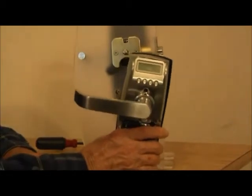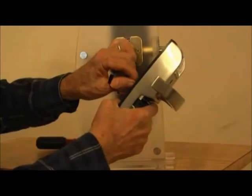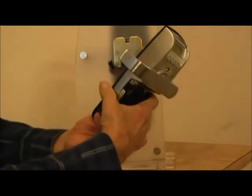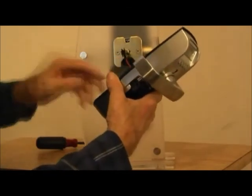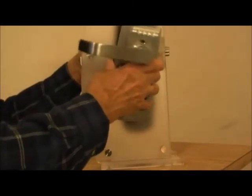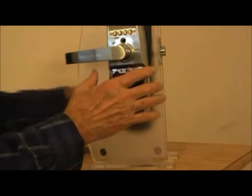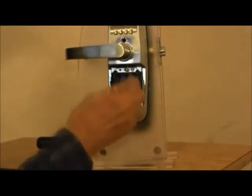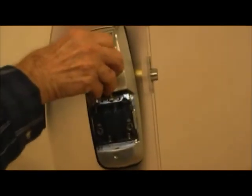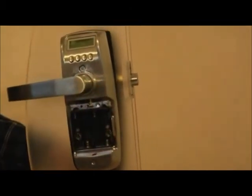Here we have the inner portion of the lock and we're going to mount it onto the door. We're going to take the cable coming out under the backset and connect it to the lock — it has a plastic clip on the top, and for the most part the cable can only plug in one way with the plastic clip pointing up. Additionally, you have the red and black cable used for external power — since this is a battery-operated lock, we're not going to use that. When you do use external power, the batteries in the lock become a battery backup. We're going to mount the lock by inserting the tail piece into the back of the lock.